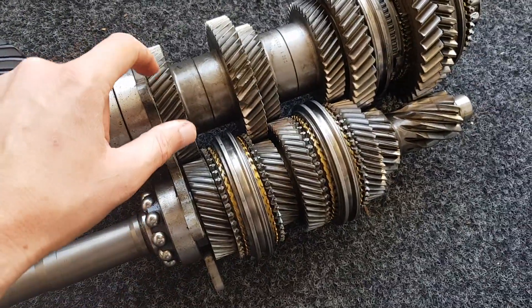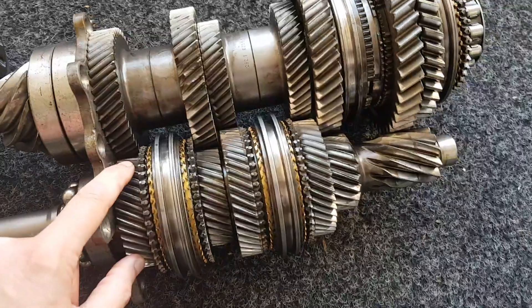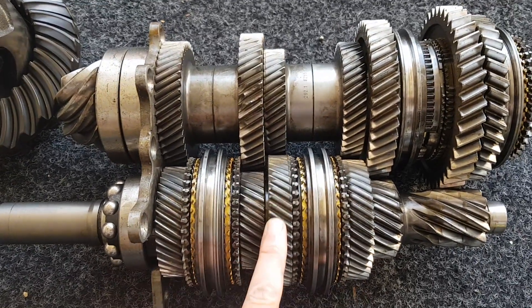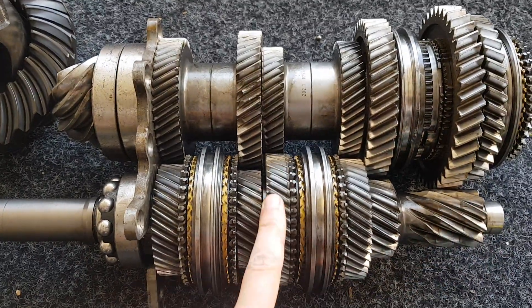For each pair of gears, one gear is rigidly fixed onto one shaft and the other gear is free to rotate. These are in constant mesh, so they would always rotate, but they're currently not selected and the shafts are apart so these can freely rotate.